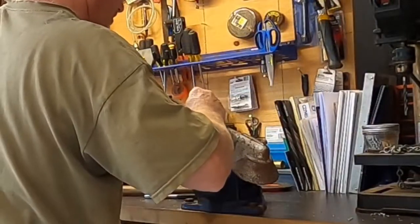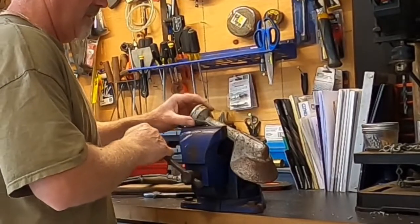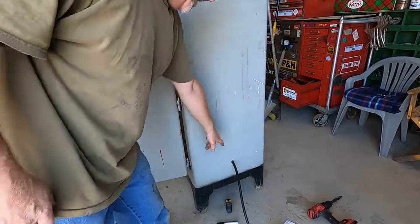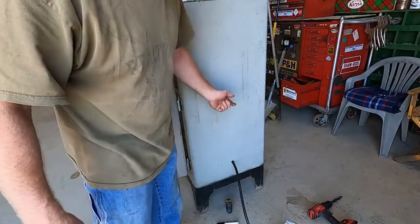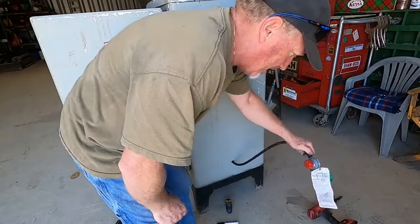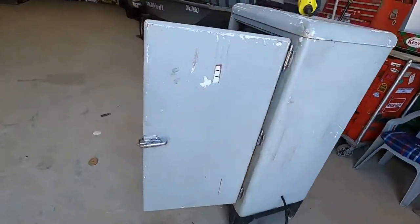You also adjust your airflow to your propane for the proper air-fuel mixture with the damper right on the actual burner itself to get a proper blue flame and the right amount of oxygen. This burner has a little damper on it too. I ended up having to go through the side of the cabinet — the hose was too short to come from underneath and around to hook up to the top of a barbecue bottle — so now we come through the side, plenty long to hook up to our 20-pounder.